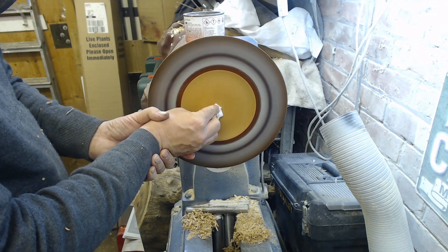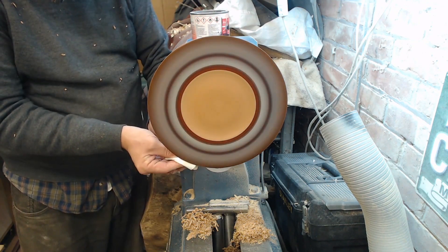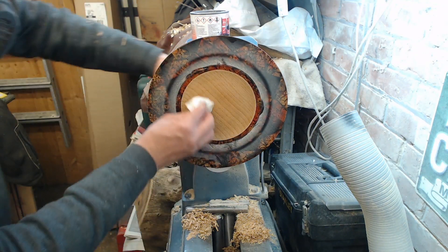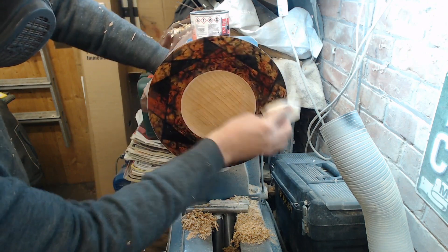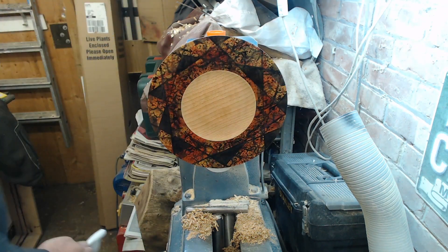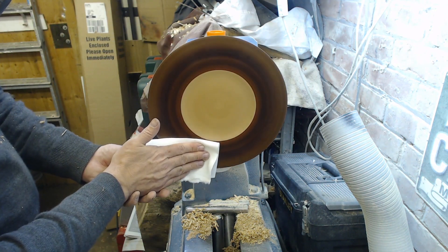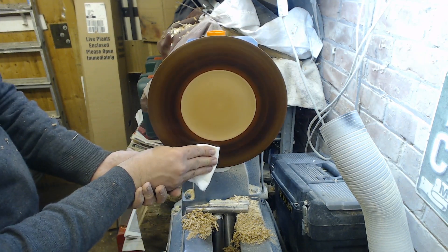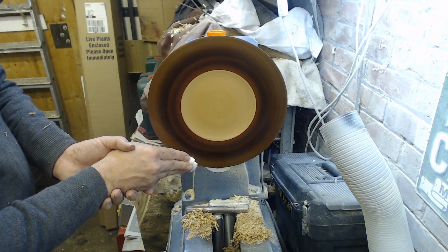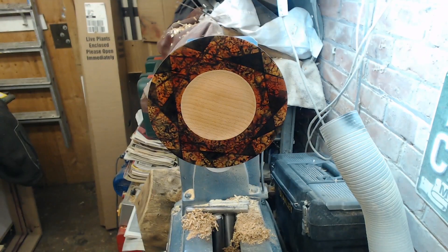I like to have wood in the middle so that you can see that it is wood, not plastic or pottery. And then I had to tidy up the back a little bit as well where I'd been rather zealous with my spraying of colours — but it came off very easily. Then wiping off the dust, and just to give the rim a bit more gleam, some burnishing cream was called into action. Put on with the lathe stationary, and then very light pressure — you don't want pressure on the cloth as that can sometimes leave it a bit streaky — just gently pulling from the centre to the edge. Very light touch.